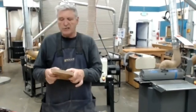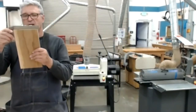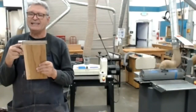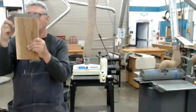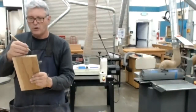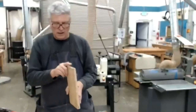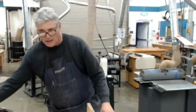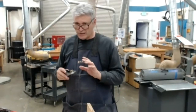We've done these two sides and these two sides. Now we're going to make the ends square. When you cross cut, if you can cross cut square, you're a heck of a lot better woodworker than I am — I can't get anything square when I cross cut even with the chop saw. I'm looking for any light with my square. I can see this is high on one end and low on the other. Just like we did on the sides, I'm going to shift to the block plane — it's the perfect plane for end grain because it does not tear out.